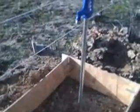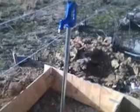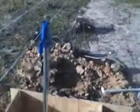And then I just had to come back in once I had all this stuff set out with my speed square and just kind of tune it up. So these are about 3 inches below grade at the bottom. I've got dirt piled against it to keep it from torquing out when the cement gets in there and pushes against it. So it should be pretty good to go. And the standpipe there is plumb. It's level on this axis and the other axis, so you measure it that way. I've already tested it. I also filled up a bucket of water to do the concrete with. So without further ado, let's get this thing cranking.